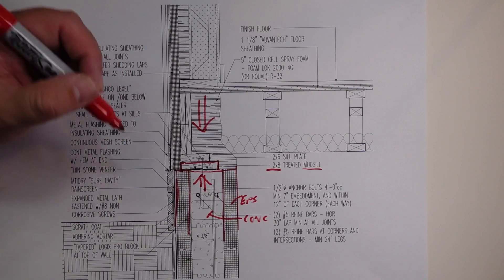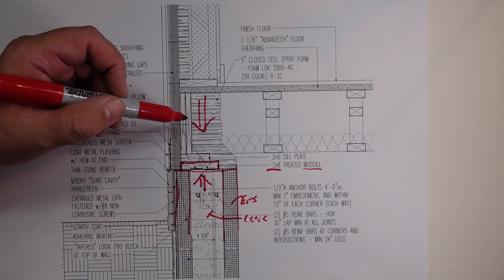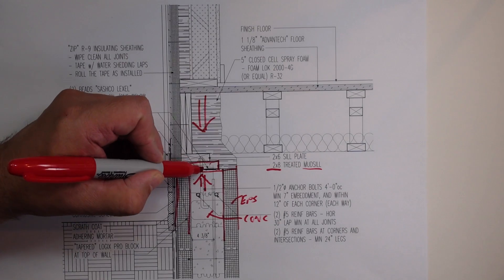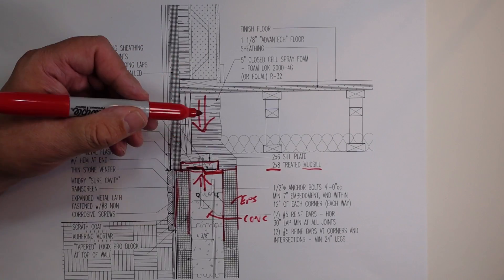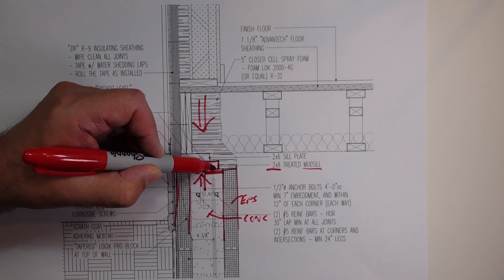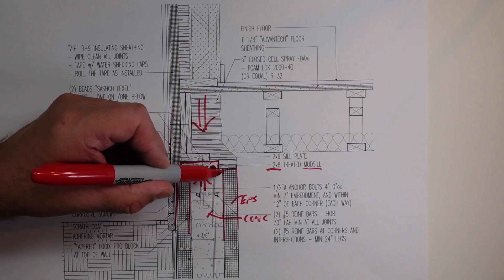Again, a lot of people would tape the exterior sheathing to the foundation wall. They're free to do their details — this is the detail that I like. That being said: two-by-eight mud sill sits down on the foundation. We use the standard sill sealer — that little piece of closed-cell foam — but we put it on so it ends up being somewhat Z-shaped. The reason for that is we put a bead of sealant on top of the foundation wall, then put the sill sealer down, and then put a bead of sealant on top of the sill sealer. So it kind of creates a dumbbell gasket, but the sill sealer itself snakes through.